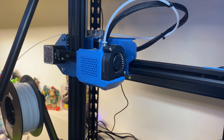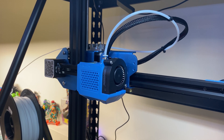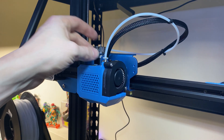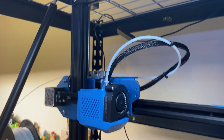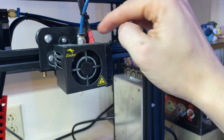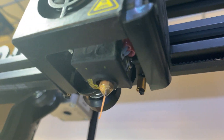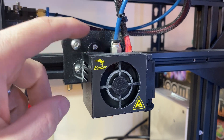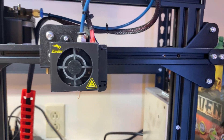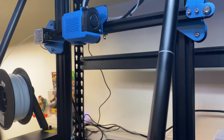That is how to install a nozzle on a CR10. A lot of them are very similar — the same process can work on just about any 3D printer. Some heads you have to take completely off and maybe the housing too. For example, on an Ender-3 you actually take the box off and then you're exposed to the actual nozzle itself. It's pretty much the same process — you can see there's the silicone box and the nozzle. On an Ender-3 and Ender-3 Pro you unscrew those, but when it comes to nozzles they all pretty much work the same.